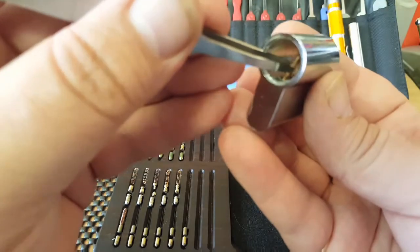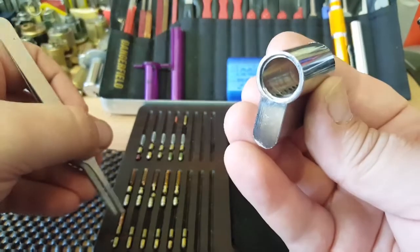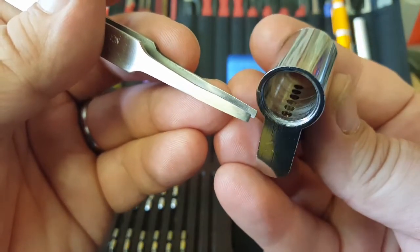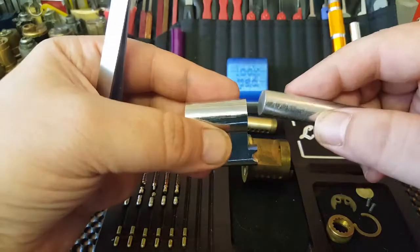It's different with a challenge lock because some springs will be higher than the shear line, but on a stop lock, if you can see, your springs should be just slightly lower than the shear line. So once you've got all your springs in, put your follower in